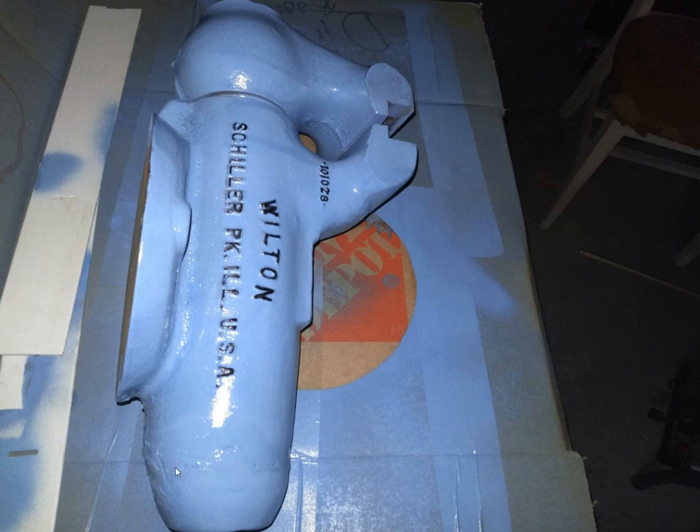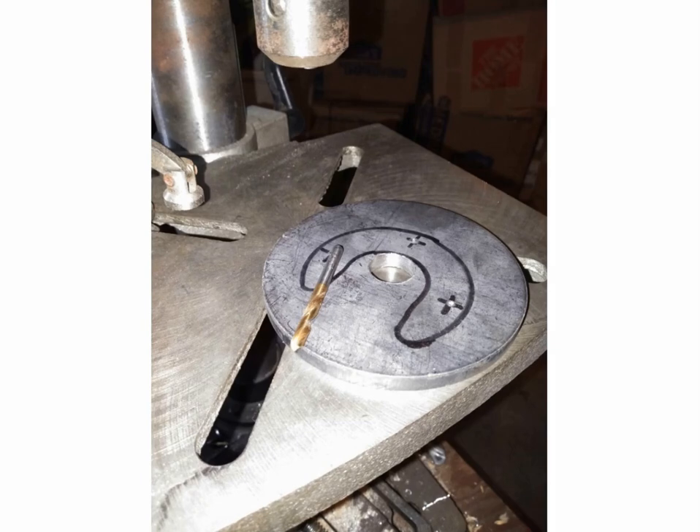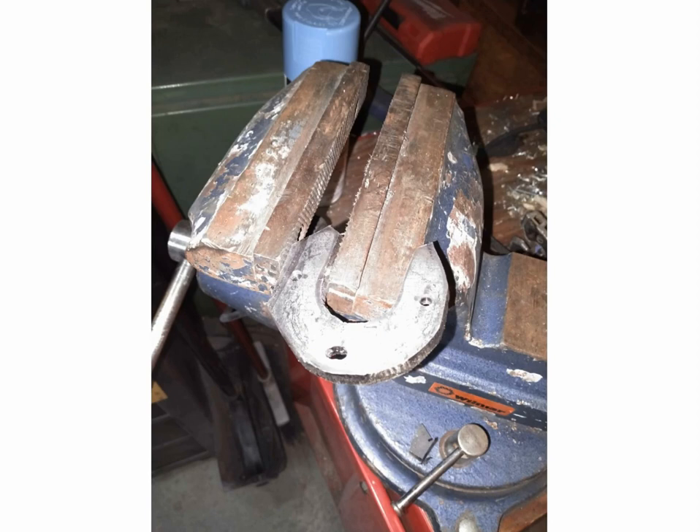You can see where the welds were, but I ground them all down to where they looked halfway decent. Now I need that keeper cog. I found a blank piece of metal at work and turned it down to five-sixteenths of an inch thick — this was off a laser scrap piece. Here I've got it marked out where I want to cut it down to, and here I'm drilling some holes for mounting it.